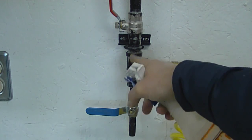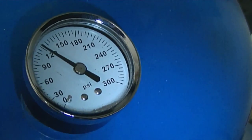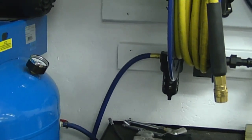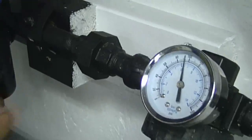It's really important that when you check for leaks you have your air pressure at the maximum that your compressor goes. By having the pressure up like that, you know that if there is going to be a leak, that's the time it's going to happen.